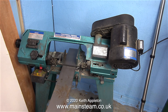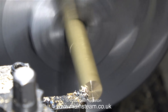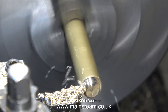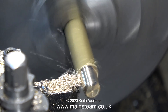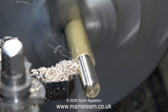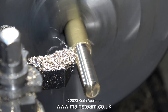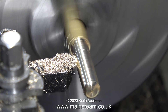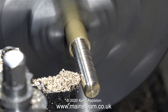For the moment it's back to this job - over to the lathe. I have a piece of brass hexagon in the three-jaw chuck. First of all I'm facing across the end, then rounding the end, followed by a longitudinal cut all the way down. What I'm making is a special holder into which the gas jet will fit, which will also be the part that I can push the silicone rubber tubing onto. I've made these before so I'm not going to labour the point. Here I'm machining some shallow grooves to make it grip the silicone rubber tubing better.